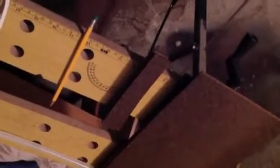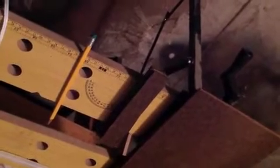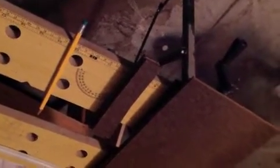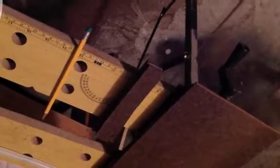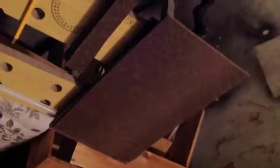So you're going to need to cut however many you need. For my project, I needed 8 of these section panels. Then you're going to need smaller section panels, and you'll see why. Mine I just cut 1 inch wide for uniformity, and about 5 7/8 inches in height. Because I have 8 of these panels, you're going to put 2 on each side, so I needed 28 of those, and that's some of them, and there's the rest over there.